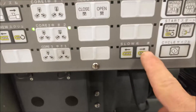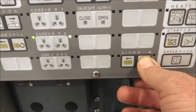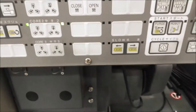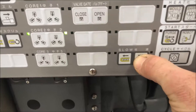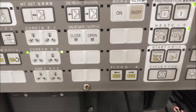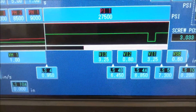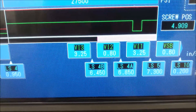Run the screw back a little — this will rotate the screw back. That is not happening, which is why you need the cold start prevention for the procedure, because it requires you to move the screw. The screw won't move with the servo off. Let's try to rotate it forward — nope, doesn't do that either. That's a problem. Wait — okay, the screw is moving back. Maybe it's because it's in emergency mode. I moved it back a little, actually I moved it back a lot.